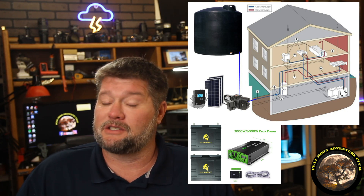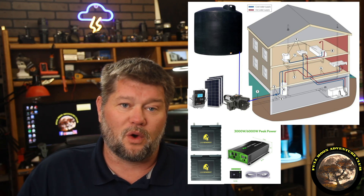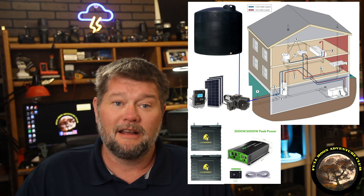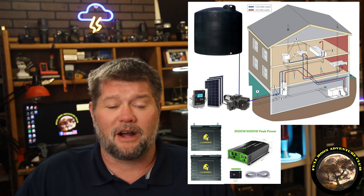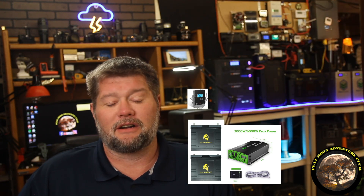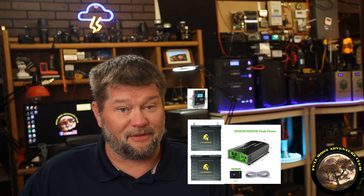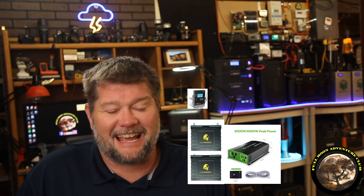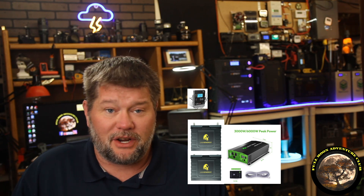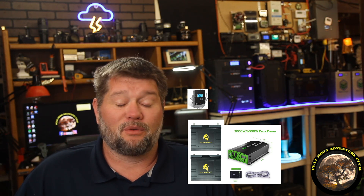This was a 240 watt solar panel that goes to a 10 amp solar charge controller, then into two 100 amp hour lithium iron phosphate batteries from Lion Energy, then up to a 3000 watt inverter to run both pumps. This will last about three to four days without sun based on that battery capacity. The reason I chose a 3000 watt inverter is because each one of those water pumps has a 1500 watt startup surge. They run at about 750 watts for a few minutes until the pressure tank fills. Since there are two pumps, if both kick on at the same time, that's 1500 plus 1500 equals 3000 watts — so that's why I chose such a large inverter. It works really well and never gets overwhelmed; we haven't had a single problem even when both pumps kick on.